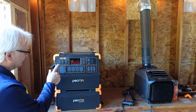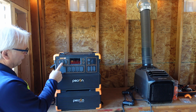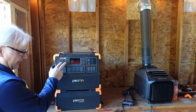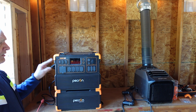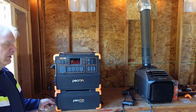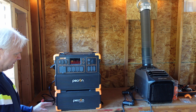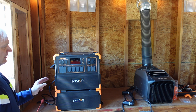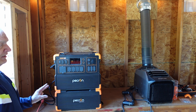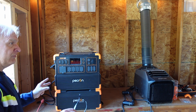What I have here is up to 150 watts of solar input on this port, 1200 watts at 150 volts on the next, and the same again — so just in these three solar inputs I have a potential of over 2500 watts of solar input. Keep in mind each one of these batteries can also handle up to 400 watts of solar on its own, so by the time this is all hooked together I'll have 9 kilowatts of storage and potentially over 3300 watts of solar input.